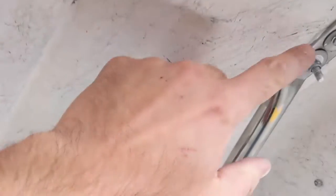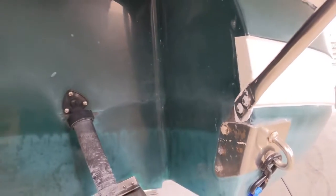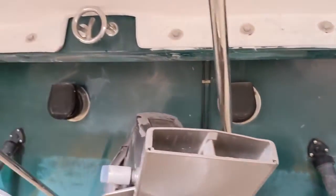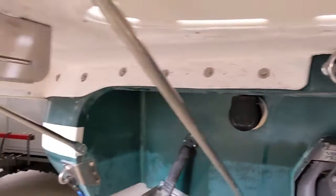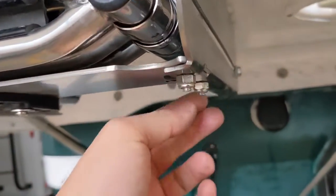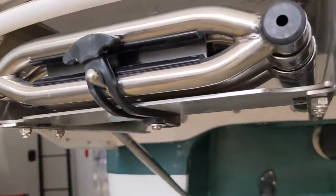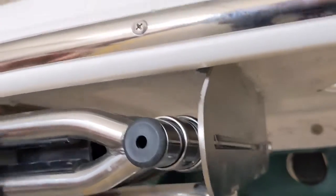And then same here, you want to put the bolt on the forwardmost point underneath the swim platform, the wood screw on the rearward part, and then the two hex bolts on the transom portion. And then once you get that done, that's all finished. You want to check your ladder bolts and hardware, make sure everything's tight. I always have a habit of double and triple checking everything that comes from the manufacturer just in case. On this one, everything was tight.